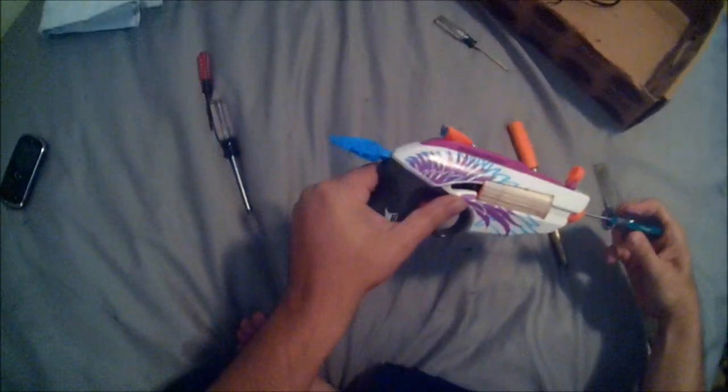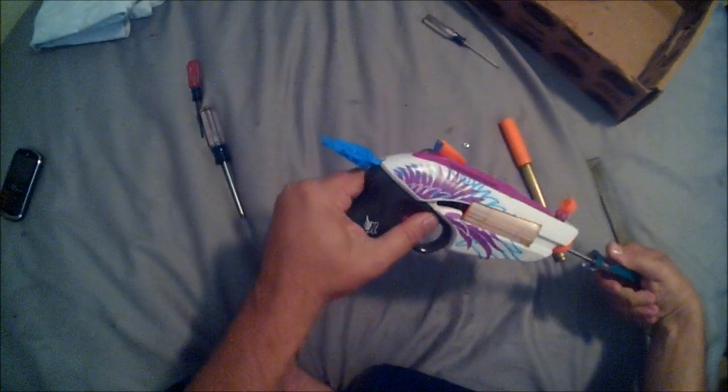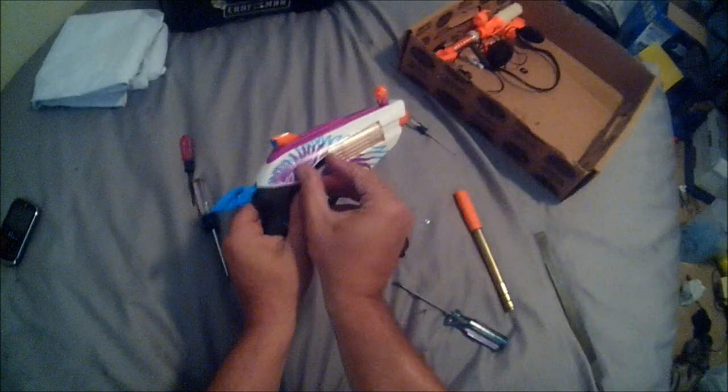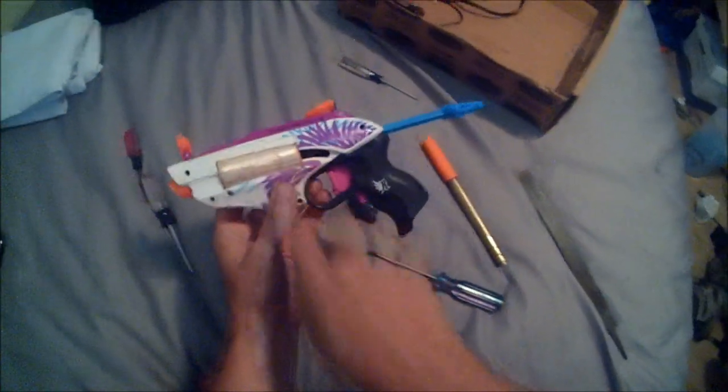Now watch the draw handle. Watch. It very slightly moved. So I'm moving the plunger head back, which makes it so the springs are more compressed and I can finally tune it. And believe me, that can make the difference between 180 feet per second and 230 feet per second. And really look at that zebra stripe pattern between the 3 springs in there.